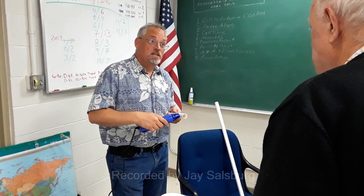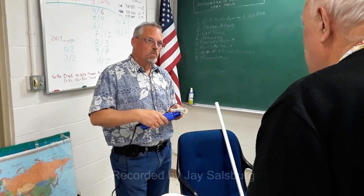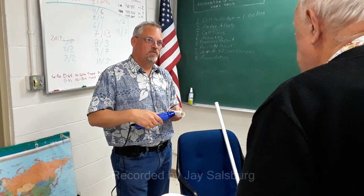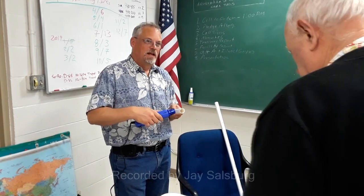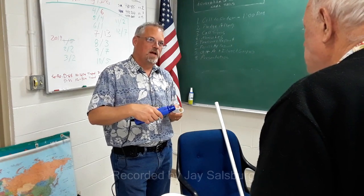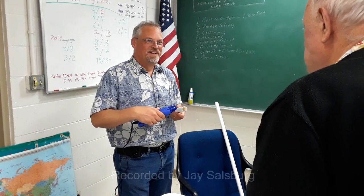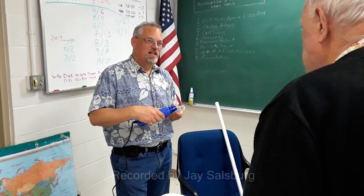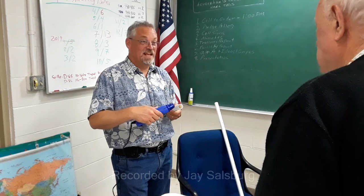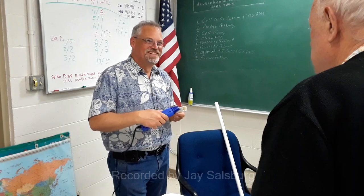Now, this isn't my idea. I got this whole principle from a Boy Scout idea. What they do is they heat up sand inside of a pan, and they take a funnel, put caps on one end, and pour hot sand into the PVC pipe, let it get hot. And then they take the PVC pipe and put it on a form wire, bend it into the shape they want, then they clamp it down, and then take the caps off, and pour the sand out. Yeah, cool. That's how they make snowshoes.